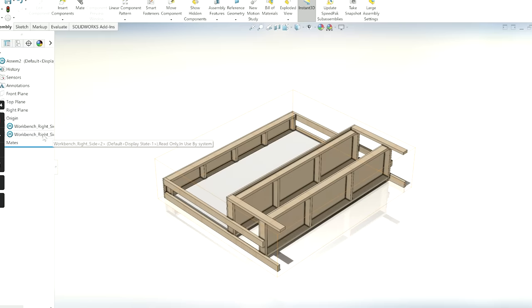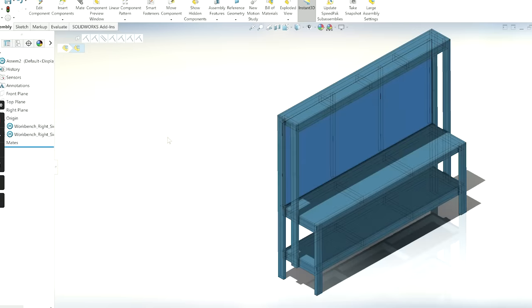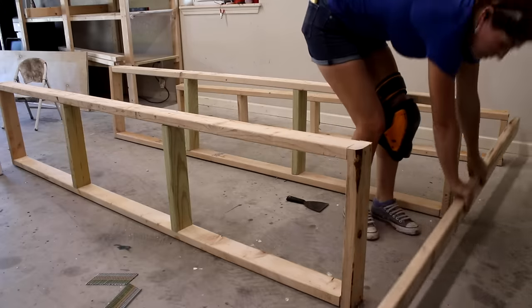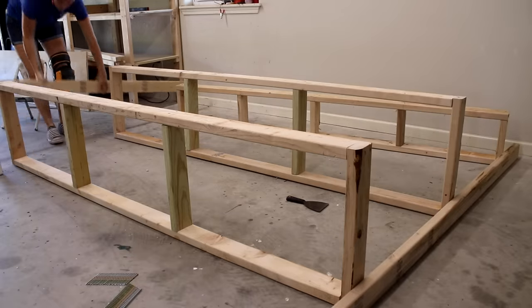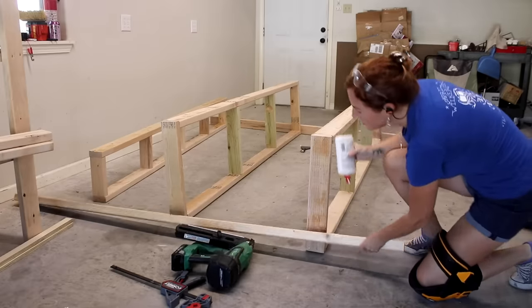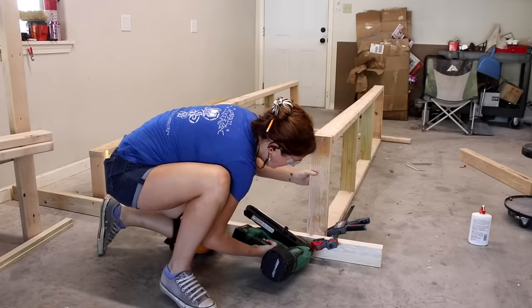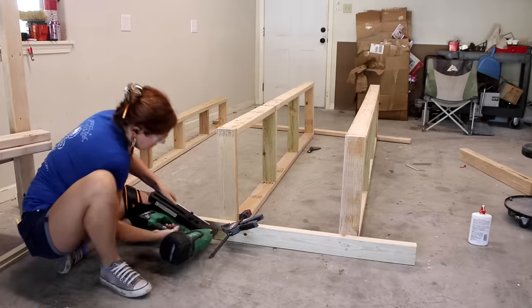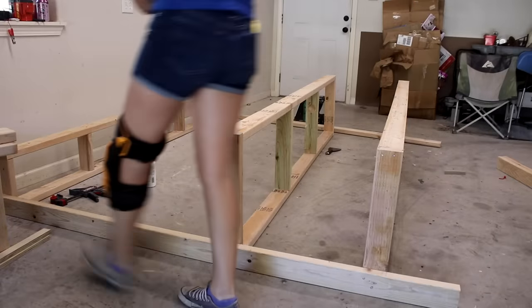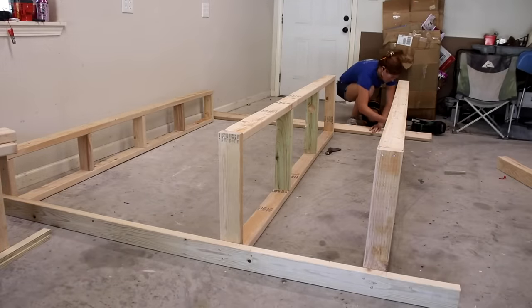My plan is to build the workbench on its back so that I won't have to be balancing the shelves while trying to get them attached to the legs. With that I flipped each shelf up to stand on end, adding the third topmost shelf to the mix, then set the leg in place on either side. I pre-marked both of these two-by-fours so that I knew where the shelves needed to be positioned, then just had to line the shelf up, glue the joint, and nail it. Note I'm using wood glue on this entire build — it is shocking how much more rigidity wood glue will give the finished project.